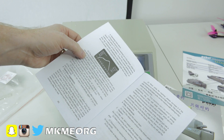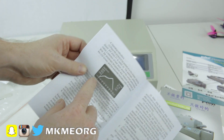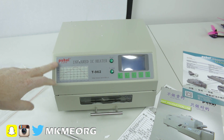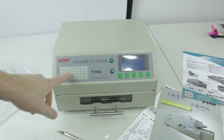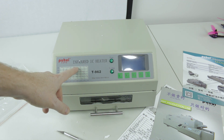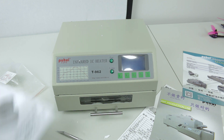I'll have to get used to this and see about setting up my own reflow curve. This is the temperature curve that we operate on — it's also on the front. The different curves we can program in over time: basically we'll ramp the temperature up, rest, then go up again, and then cool the boards down. That'll reflow our solder on our surface mount boards.